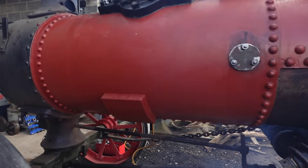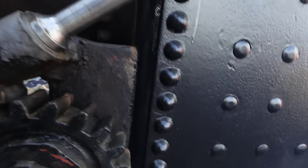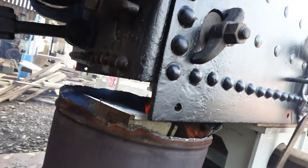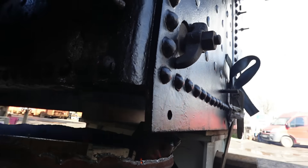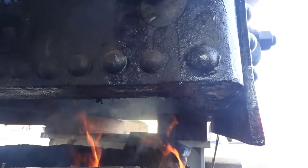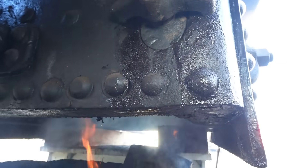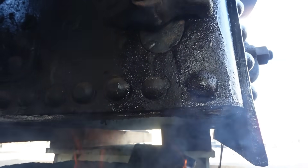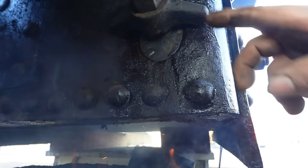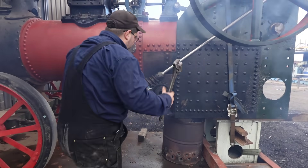While she's heating up I'm just going to check in to make sure there's no leaks on any of the patches we've done — under the mud hole doors or the hand holes. You can see a drip there on this one, so this one's just weeping a little bit — it was just dripping at a tiny bit in that corner, so I'll give it a snug up and nip that one door up.